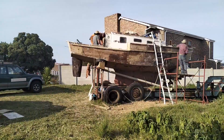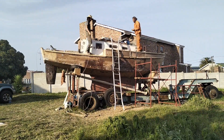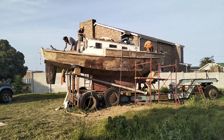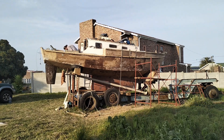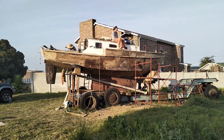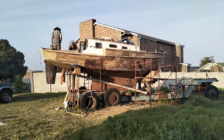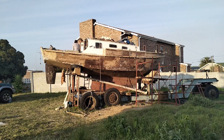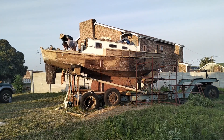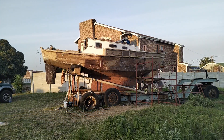Stuff that's not captured on the time-lapse: after I sanded all the areas, we were working with some laminating epoxy and I managed to paint that half of the starboard hull. It's just the upper deck area — the raised deck area — that's not painted, and the keel and below the waterline, but at least that's already epoxy treated, so that can soon get some base coat.